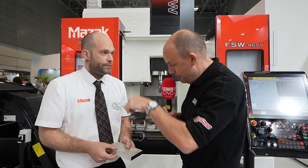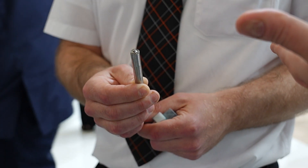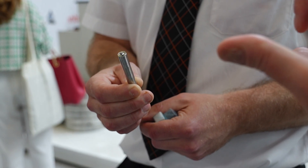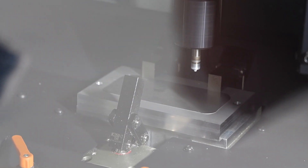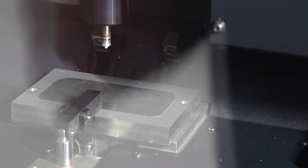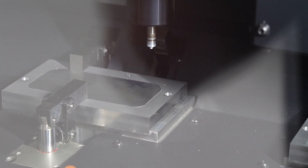What about that particular tool? You're not using material from the tool to create the weld — the weld is coming from the material here? Yes. The tool just makes this material soft and then stirs it up together. So how does it calculate that process in terms of speed, depth, pressure, and power — all the things that make a weld?